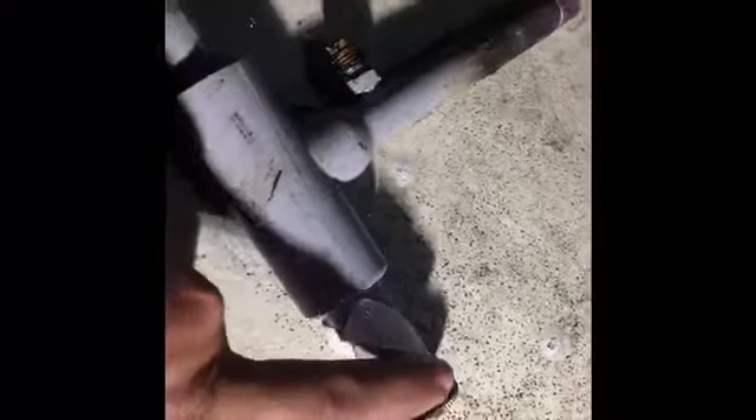A lot of times you'll find the cap leaking, but it's actually coming from the set screw and the leak is coming out that way. Let me pull a good vacuum on the system and charge it up — we'll see how it goes. The insulation is wrapped up on the valve, everything nice and covered. I also replaced the dryer. Let's pull a vacuum and charge the system up.